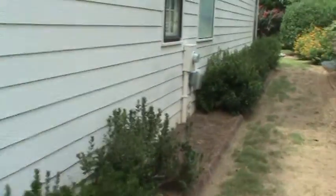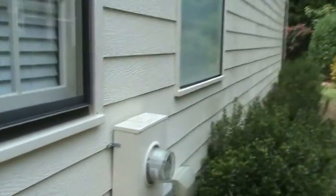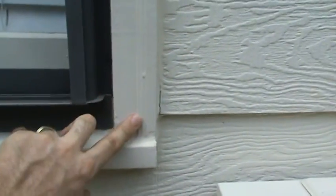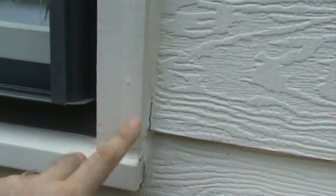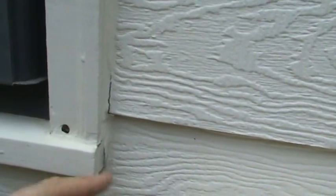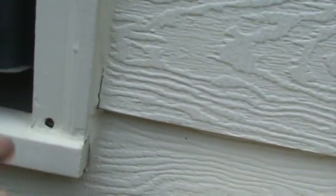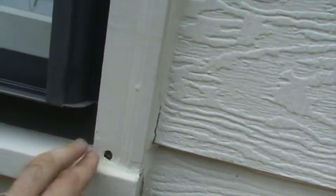You're going to come across areas where the caulk has failed. Before I put a hole through here, it looked good — that's the trick with this stuff. When we pull it off, you'll see the brick mold behind here was never back-primed. The bottom edge and the back were never primed and sealed. As it got moisture from failed caulk and from the storm windows, the water got behind here. If it had been back-primed, it would have just shed to the front and never rotted out.